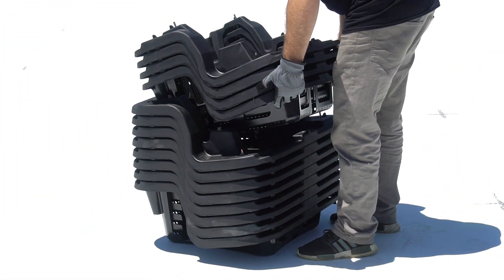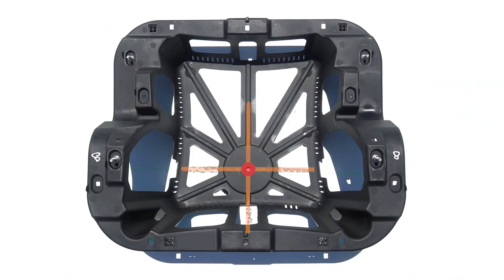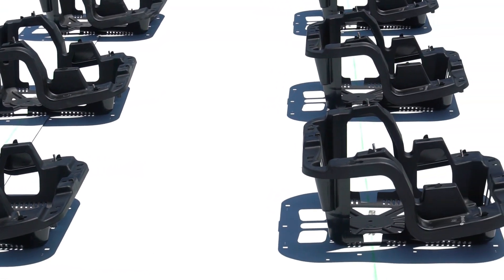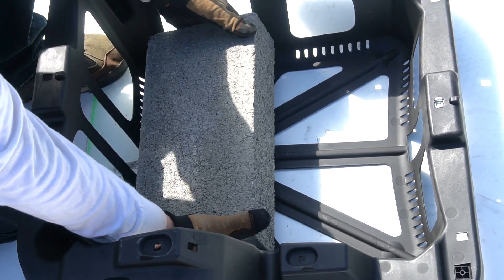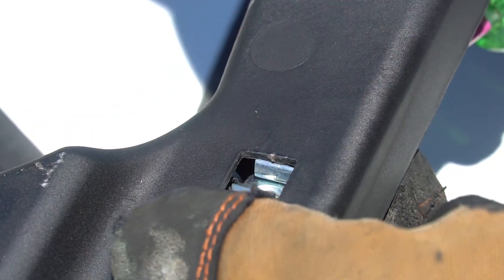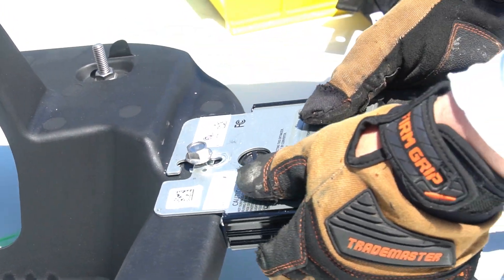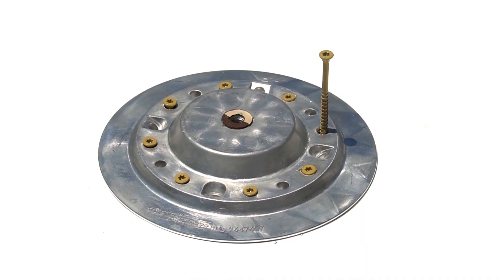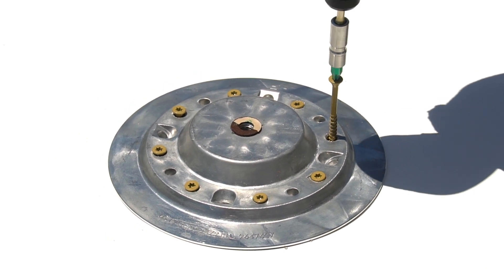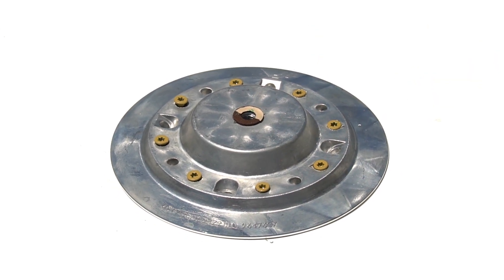The chassis can now be placed on the marks. Place chassis so the center hole at the bottom is aligned with the marks on the roof. Once all chassis have been placed on the proper marks, load each chassis with the required ballast in your design plans. If using module level power electronics, install cage nuts and attach devices using the provided MLPE mounting hardware. If using the flat roof attachment kit for hybrid systems or seismic anchors, install the fixed attachment points on the roof. We will cover next steps for anchored hybrid systems in a bit.